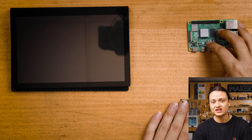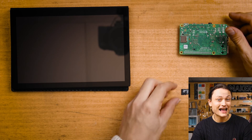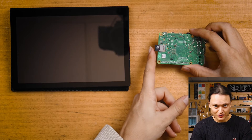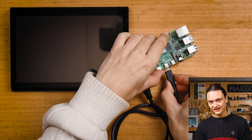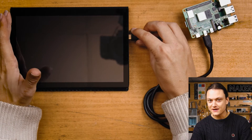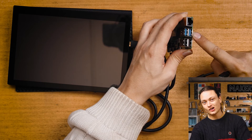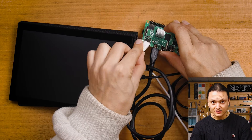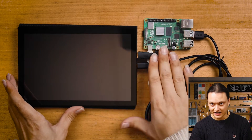We are simply going to set up this Raspberry Pi as a desktop computer with the DF Robot display as the touch monitor. Insert the micro SD card — flashed using the Raspberry Pi Imager — into your Raspberry Pi. There's a link in the description if you need help with flashing. Then connect the micro HDMI to the mini HDMI on the screen, and connect the bottom USB 3.0 on the Raspberry Pi to the middle USB-C port on the screen.